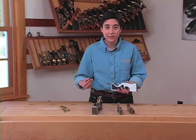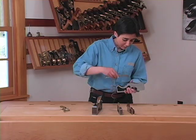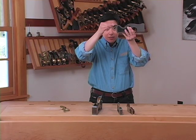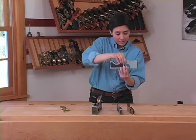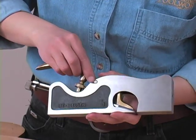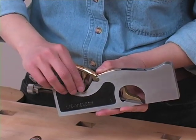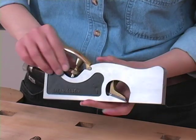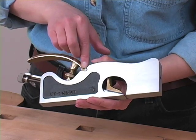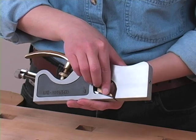We'll go ahead and put the blade back in, basically reversing the motion that we used to take it out — putting it in, and then turning it 90 degrees and laying it down. Now let's make sure that we get the slot in properly, and now we'll put the bronze cap back on. Make sure that the pivot point is seated fully into the notch, and tighten down the spin wheel by turning it clockwise. Tightening the spin wheel does two things: it puts pressure on the blade to hold it in place, and because we have a pivot point, as the back of the bronze cap comes up, the front comes down, putting extra pressure on the blade right next to the cutting edge.